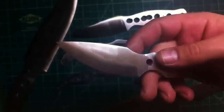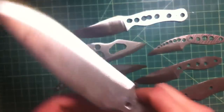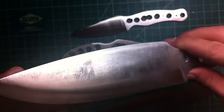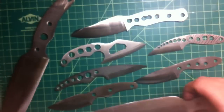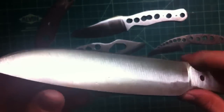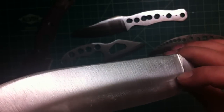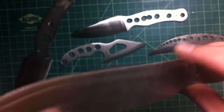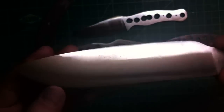But so far looks pretty good. Finished also the choppers — reprofiled them. This one is ready; this one was ready when I did it first time. But I fixed up the grind on the big one because that needed a lot of work still. Got a nice grind now — starts from here and goes nice continuously down. Should be a nice sharp angle.